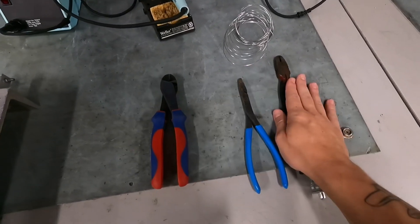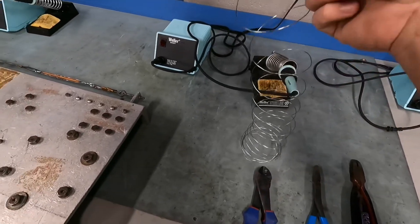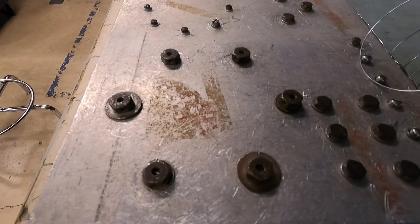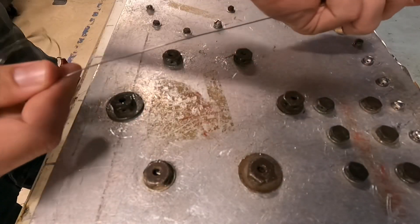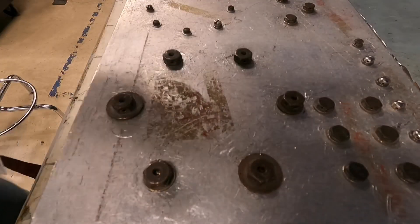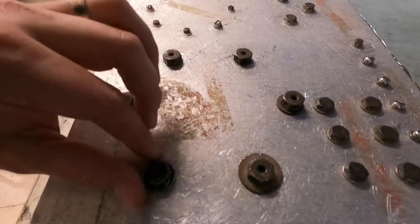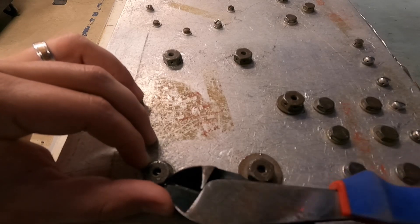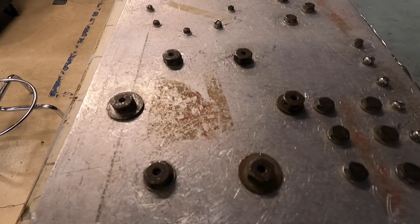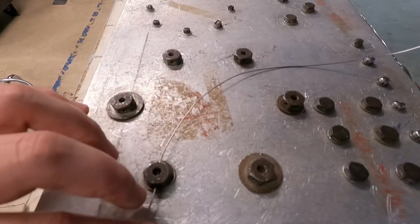Let me give you a pan of the tools I'm going to be using: a pair of safety wire pliers, a pair of duckbill pliers that you may or may not need — safety wire pliers can serve the same purpose — and then a pair of diagonal cutters and some safety wire. This leads me to my first tip: making sure that you select the right wire. This is actually 032. You might be really tempted to grab something like 025 because it's easier, but it's easier because the wire is not big enough. So make sure that you're using the right wire for the bolts that you're using.